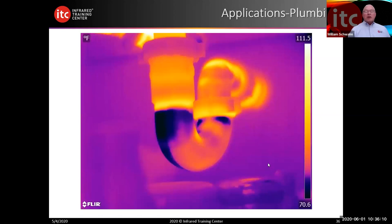One thing we don't think about using IR for is plumbing. We have a plumbing trap with a blockage — where is that blockage actually located? Is it further up in the pipe or at the bottom of the trap? This is easy because what the camera is seeing is really basic: more radiation or less radiation. The blockage has a different ability to emit energy than the rest of the pipe, so you're seeing more or less emitted radiation.